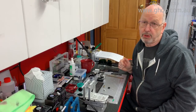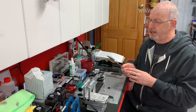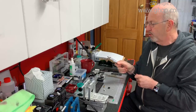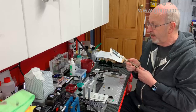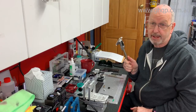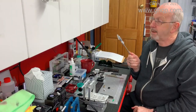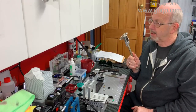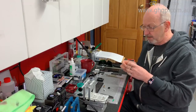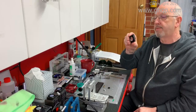A couple of things that are really essential when doing this sort of work: first, a set of calipers like this — it enables you to measure things more accurately. They're relatively inexpensive and most hardware stores and shops that sell machine tools will have them. You can get plastic ones but I'd recommend getting metal ones. The other important thing is magnifying glasses — I use this one a lot, it's a 20x, and this one is about a 10x. They allow you to look really closely at the results from the laser engraving.